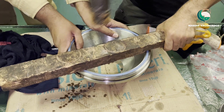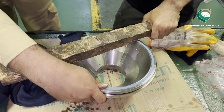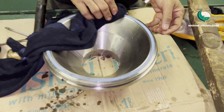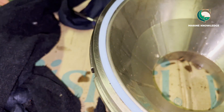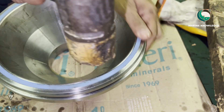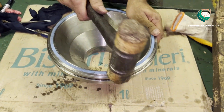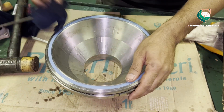Ask someone to hold the bowl. Give it a tap, and when using a wooden piece, always ensure there are no nails present in the wood. In urgency, people sometimes use the wrong material and nails can damage the seal. That is all — we are done with fixing the seal ring. You can see the seal ring is completely fixed. Give a tap if there is any slight protrusion. Usually when it is in place, after 2-3 desludging cycles the seal will get seated by itself.